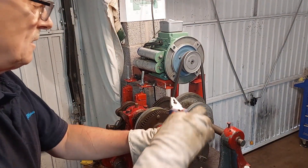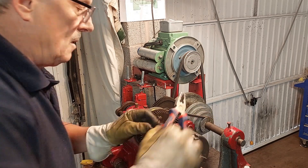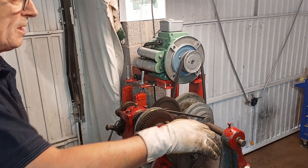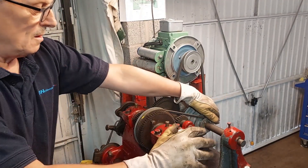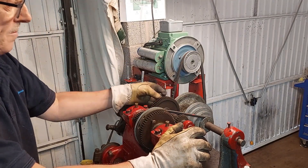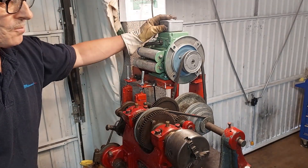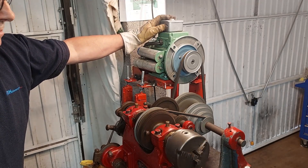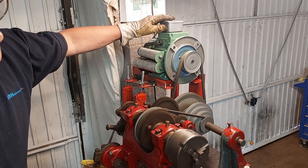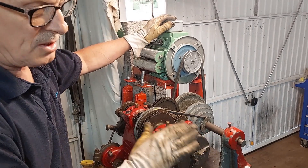That's one pin out. Okay, that's the other pin out — so now the chuck is spinning independently from the rest of the gearing. Now if I engage the back gear, have a look how slow this spins now. You've got this spinning really slowly so you've got a lot of torque.